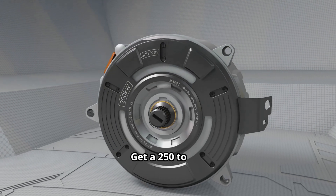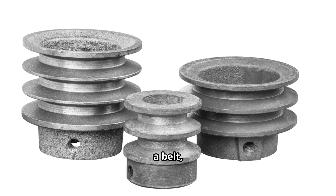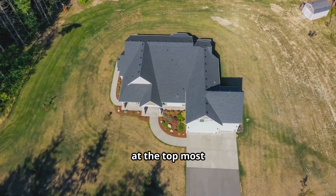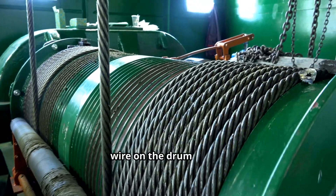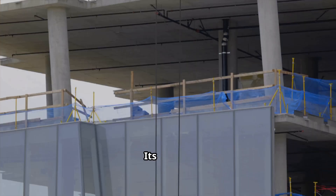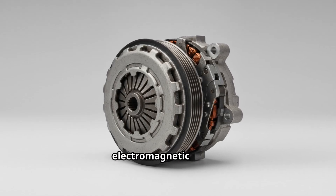Get a 250 to 500 watt three-phase brushless motor from an electric bike — it has permanent magnets inside, so when you turn the shaft it becomes a generator and produces electricity. Get two pulleys and a belt: add one pulley to the shaft of the generator and the other pulley between the clutch and the gearbox. Mount the generator on the same wooden base and couple the pulleys with a belt. After that, mount everything at the topmost part of your house, making sure there is enough space for the weight to safely hang or travel down. Finally, wind the steel wire on the drum pulley with an extended metal arm that has an additional pulley connected at the end, from which the steel rope falls and holds the heavy weight in place on the ground. This heavy weight can be a discarded cemented structure; its weight depends on the power of the wind turbine, which ultimately has to pick it up.